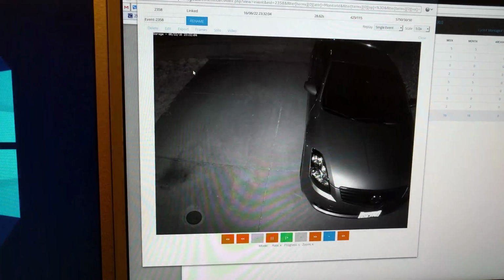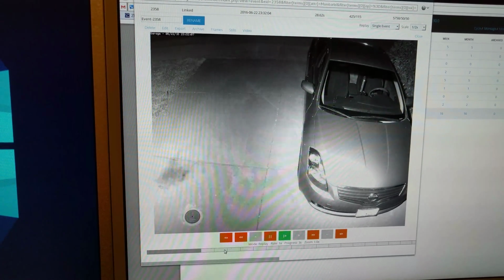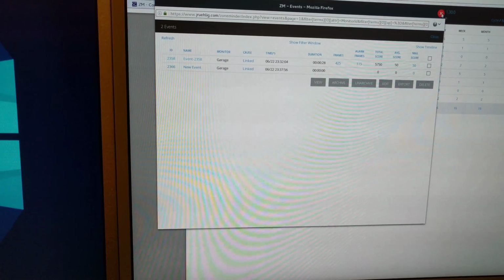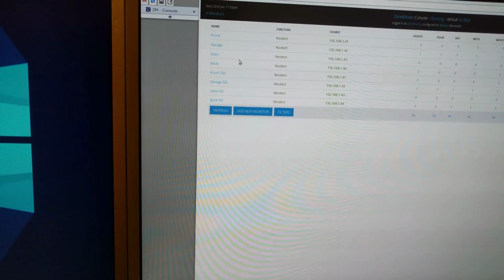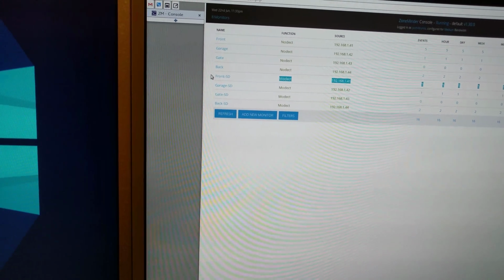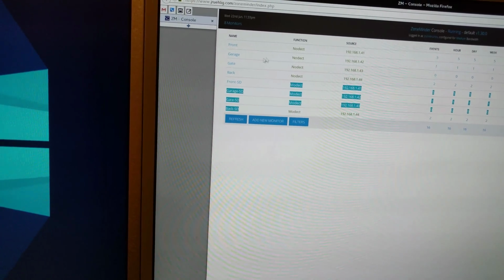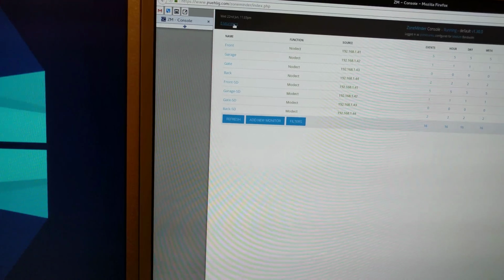This, oh, that was actually an event, right? Yeah, that's me filming it earlier. So these are all from right now because I deleted all my events, like I said. What it does is actually have the HD versions of these linked to the low-res MJPEG one. So if these trigger an event, it actually just records on here, but it doesn't have to analyze the larger image. So that's basically my ZoneMinder setup.